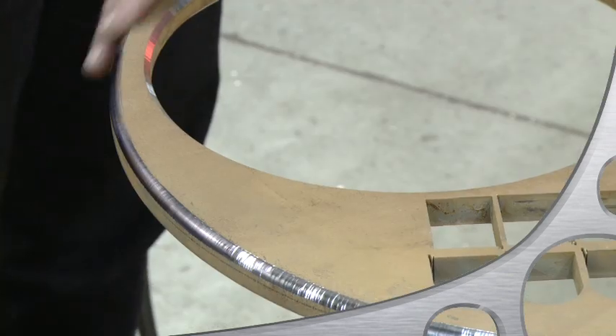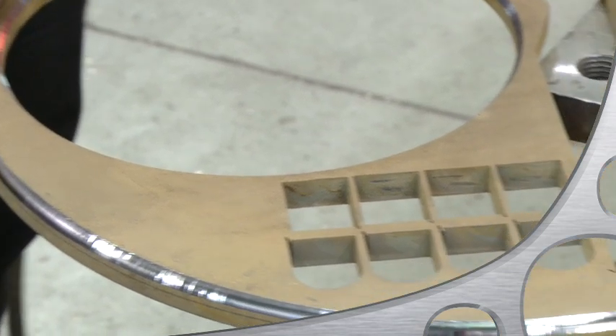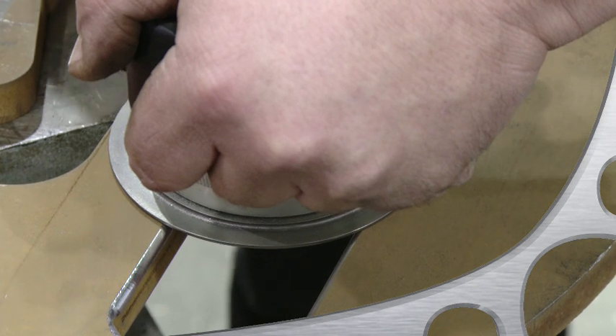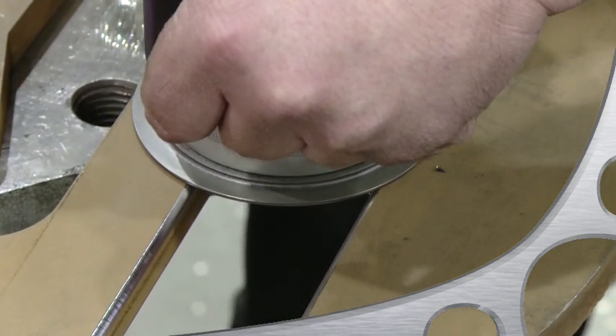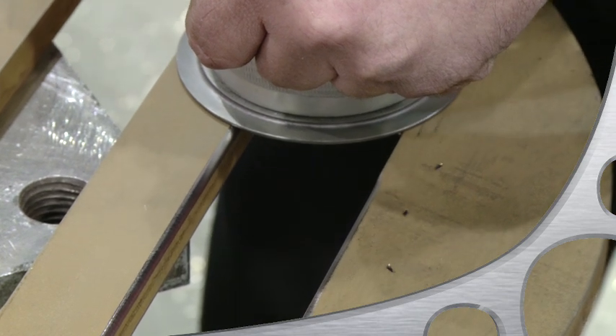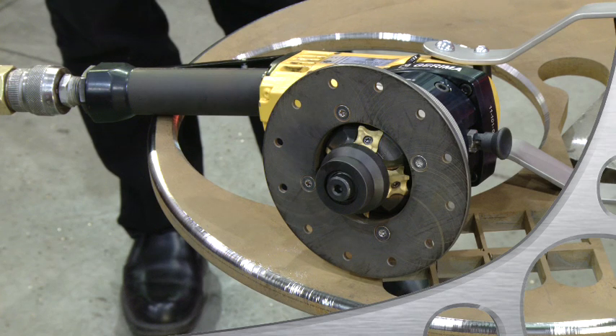This is a wonderful feature when you need to paint or coat your workpiece later on. Paint is much less susceptible to chipping on rounded edges than on sharp edges. All you ship builders, bridge builders, and anybody else who has to coat and paint — you'll love this. Imagine having to grind such a smooth and uniform edge.